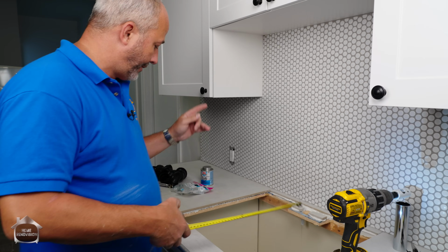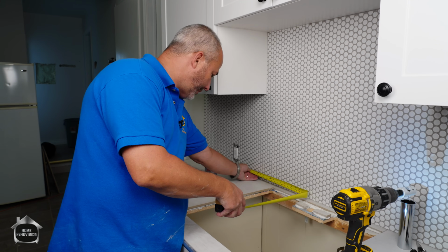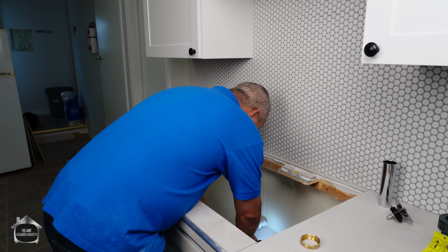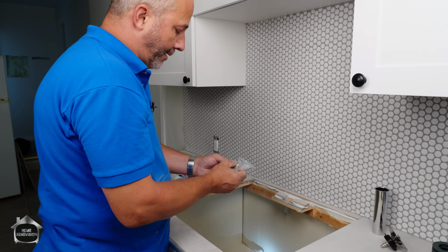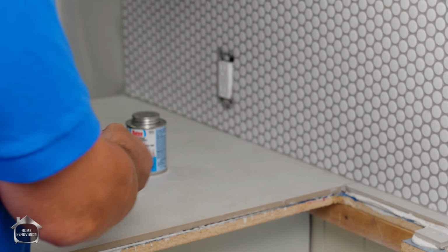I have my drain behind this wall, and I've got my water supply both behind this wall. And it is 16 inches from that plug right there. So I'm going to bring these water lines both through here, and I've got Shark Bite 90s, right? Let's take a look at this. Whenever you're doing plumbing, you want to consider, do you want to have your shutoff valve coming straight out, or do you want it off on an angle here?